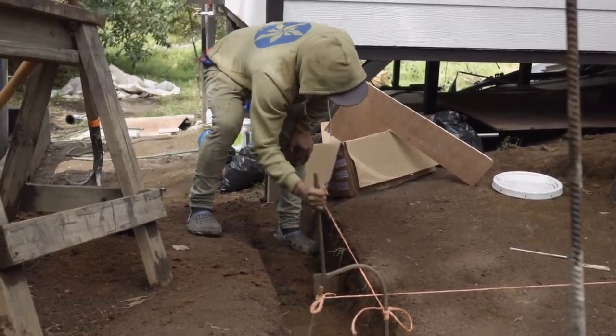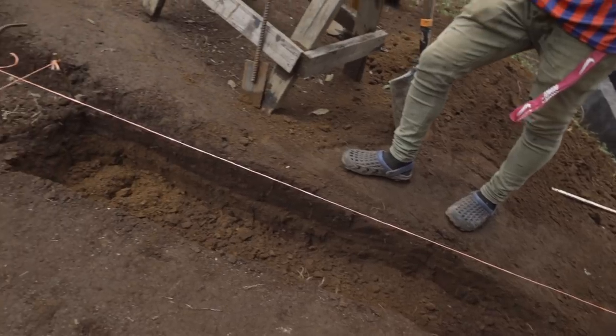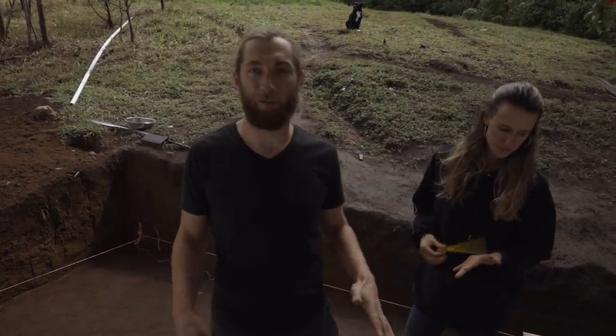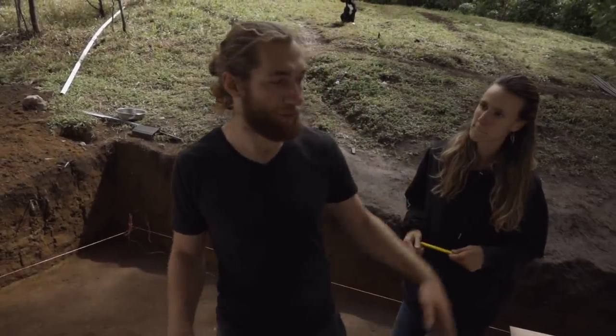While we've been building these drawers, we have Iberto working on our retaining wall out here. So the idea is to have a brick retaining wall going all the way around where the string line is. So he's digging a 1 foot by 1 foot footer that's gonna go all the way around first. We're gonna pour cement and then build it up with blocks.